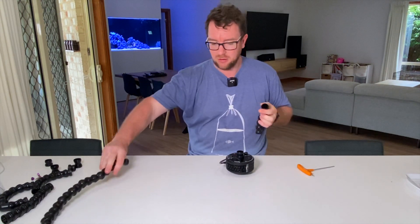Obviously the other end where you mount it will depend on your application. If you've got T-slot like I do, you could run a titanium bolt or a stainless bolt with a little T-nut on the end that will allow you to put it in your T-slot. Or, even though I've got T-slot, I've actually drilled a hole all the way through so I can put the bolt all the way through the T-slot and then just secure it with a titanium nut.